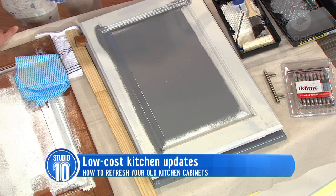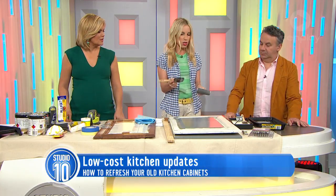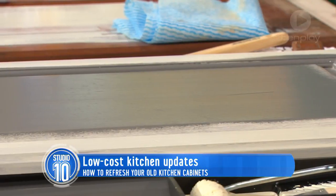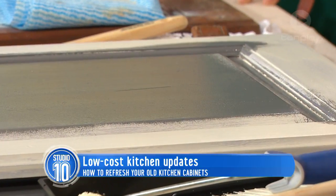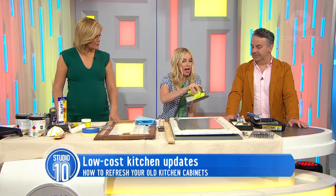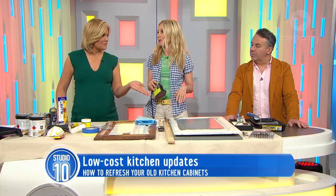That's all you do — you paint your whole cabinets like that: tops, bottoms, backsides. Then you wait for that to dry — you should wait overnight. Sometimes with your brushes you can see little bits of lint in the paint, so wait for that to dry. Wait till it's dry and then give it a light sand in between coats. That's the most important thing — you have to sand in between coats and that's how you get a really good finish.